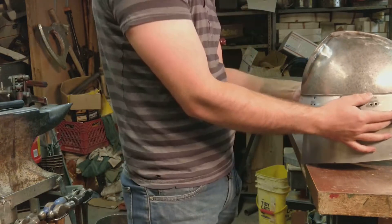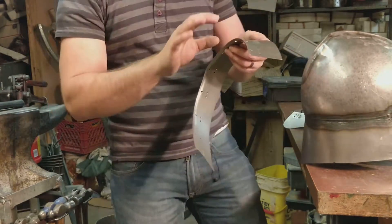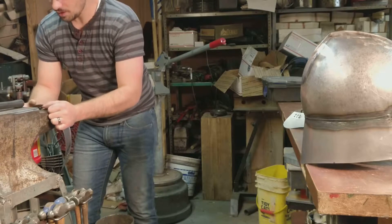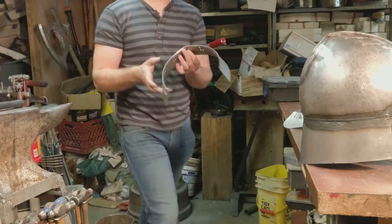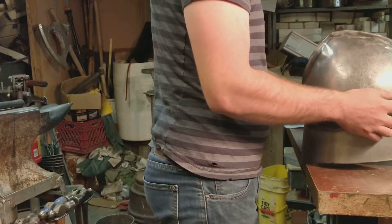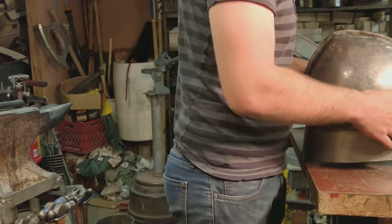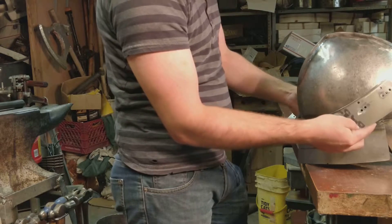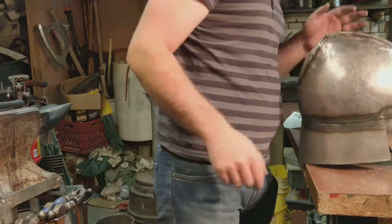Part of the trick is that we have to make sure this guy is almost a perfect fit. We've got it to where it's really, really close — this side's good, we have a little bit on this side, just trying to get it nice and even because we're going to be using this as a basis for our other pieces. Just need to adjust exactly where our bend point is so that it fits right — there we go. Now we are within acceptable tolerance. We'll mark the center hole and then do each hole individually as we move out to make sure it's nice and level.